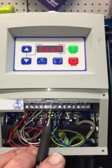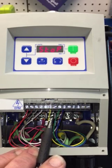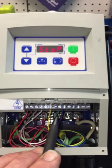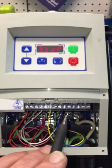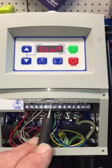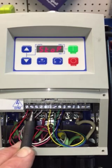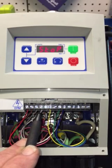The red wire is for your stop button, green is forward, blue is reverse or counterclockwise. So you're using pin 1, pin 4, pin 13A, and pin 13B. Pins 2, 5, and 6 are for your speed control — for your potentiometer.